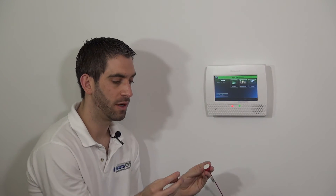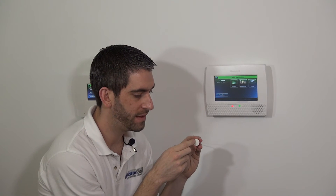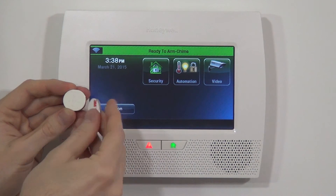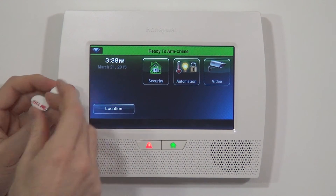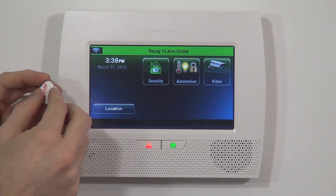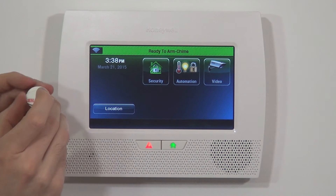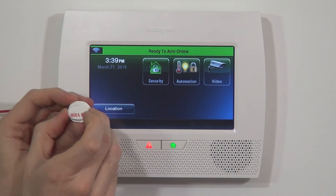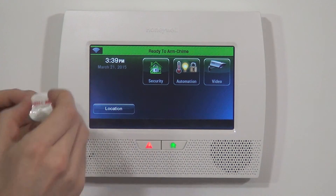With a lot of other sensors, you have little hash marks indicating where it goes. On this one, there's actually polarity, and the reed switch is actually lined up with these little plastic markings. So if you had your sensor the long way and your magnet turned a different way, your polarity — positive and negative — is not lining up properly with your reed switch, and it wouldn't work. You have to make sure when you drill your holes that when the door is closed, both ovals are in line, so that it will actually detect the magnet and see when the magnet's there or not.